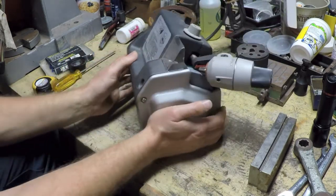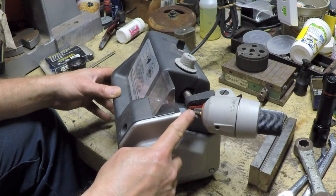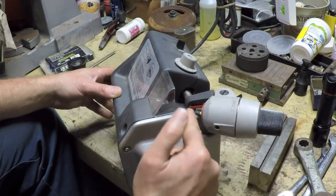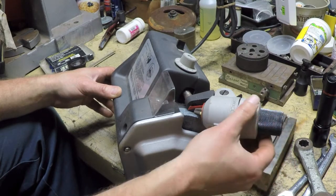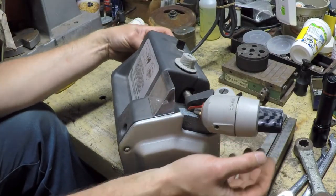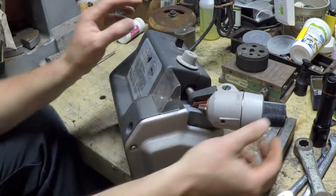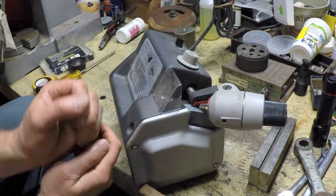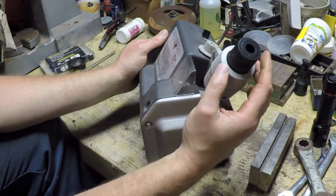The business end has almost a drill chuck with jaws, so as you advance it, it clamps on different size drill bits. You insert your drill from the back side and clamp it, and there's a camming action that rotates it around to mimic what experienced guys do when rolling their wrist as they do a hand grind on a regular pedestal grinder.